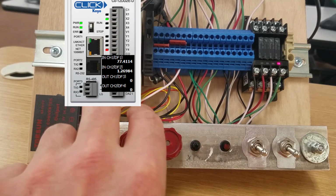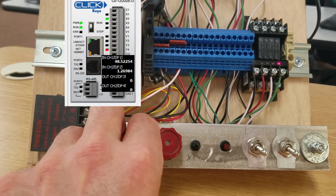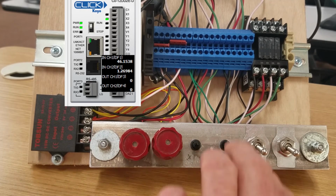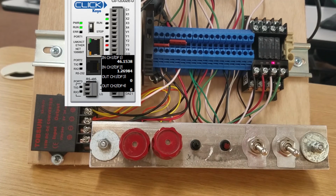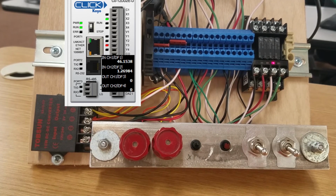During the draining cycle, as it starts to drain down, let's say I drop it down to 40%. If somebody hits stop, it will stop draining, but the product has already been mixed at the ratio it's supposed to be at, so we don't want to refill. If I hit start again, we go back to mixing, we mix it for another 30 seconds, and then back to the drain cycle. The process will never refill with product until it has satisfied the condition of draining all the way down and then that additional 45 seconds.